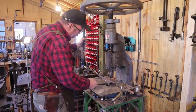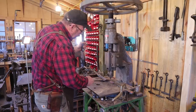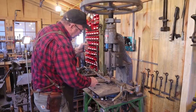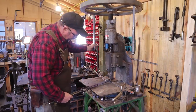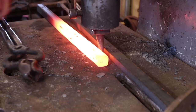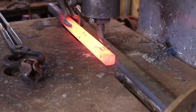Try and make your cut an even depth. You could set the depth stop on the fly press to account for that, but it's not too hard to just eyeball it. Trying to eyeball a center line with a fly press is very difficult because the chisel is up in the air and you can't put it on the work to compare it. Straighten it out at the anvil between cuts and do one cut on 180-degree faces — the first face is down, then we'll do the sides.